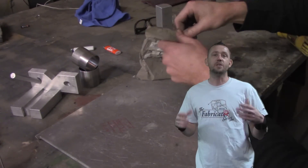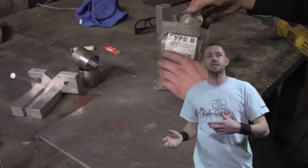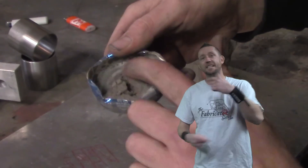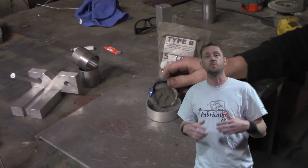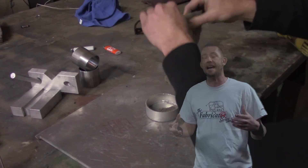Solar flux is a chemical compound that comes in a finely ground powdered form. That powder is then mixed with an evaporative solution to create a paste. The paste is applied to the inside of the part at the weld joint, which serves as a barrier or shield against atmospheric gases when it's welded — basically eliminating the need for argon gas as your shielding gas.